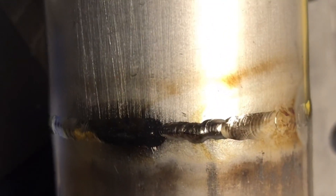I welded up this practice piece. You can tell where I started — it wasn't getting hot enough there, and there's a spot right here too where it didn't look hot enough. Then my consistency started getting better and it started looking really good right here. The tie-ins are pretty good. The inside was kind of hit and miss, but you can see in the spots where it did look good on top, I also got really good penetration on the inside. The color inside is silver, which shows I'm getting good purge. I do have lack of penetration in some spots but for practice, I think it came out very good.